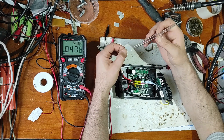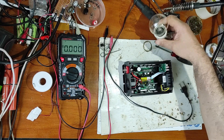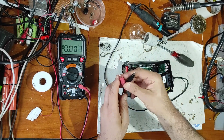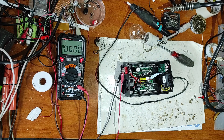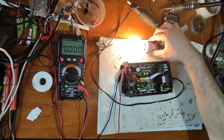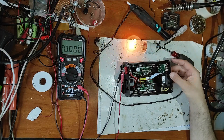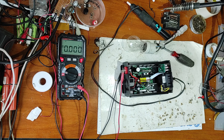Now let's put everything back. Be very careful and put the insulation pad back. Now let's test this inverter - I will use a 75 watt lamp and put my power supply on 24 volts and 5 amps. No power consumption because it's off. Now let's turn on - it has soft start. I have 4 amps power consumption. Everything seems good - it's not warm, it's cold.